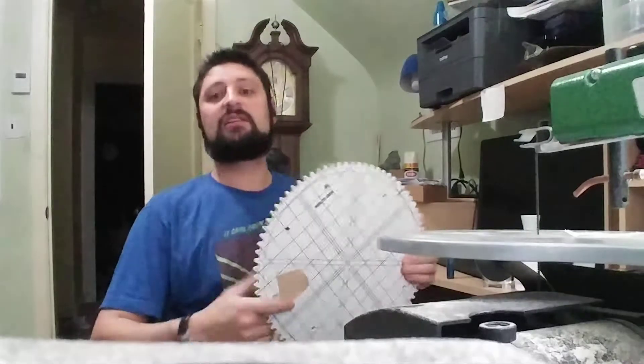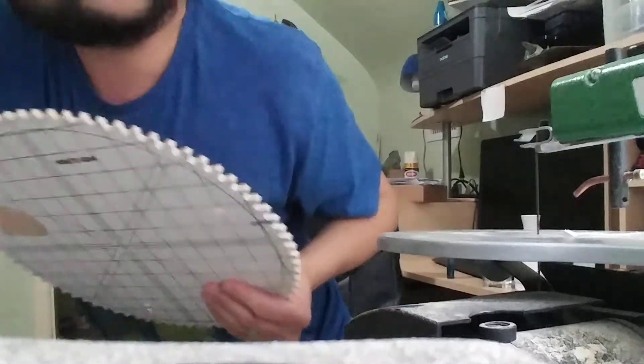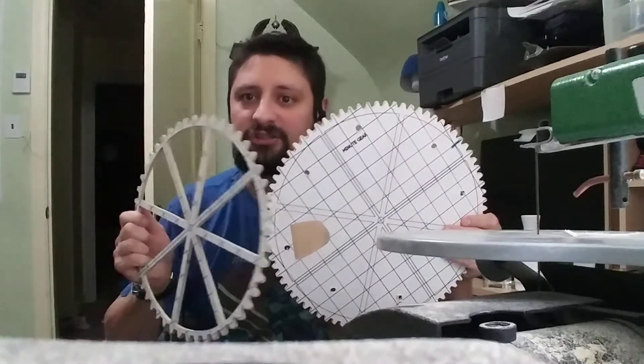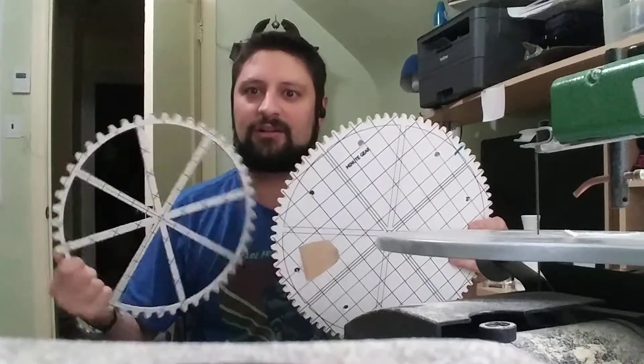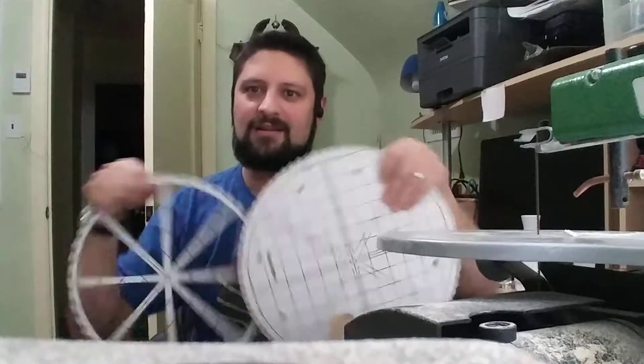What I thought was worth documenting is this: in the rabbit peace tower clock I made a few custom gears out of wood, whereas the rest of the clock is made of paper. Those gears worked out fine. The problem wasn't that the teeth didn't mesh — the problem was that I didn't get the gear on straight on the axle, so it would wobble as it turned. The gear would wobble and every once in a while, like once or twice a day, the teeth would slide behind the others. That's not the gear's fault and it's not the axle's fault — it's the paper frame that just sags and warps.